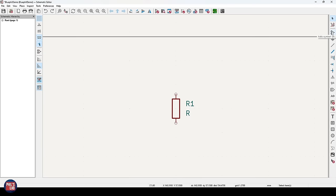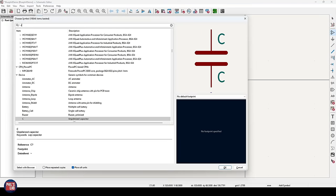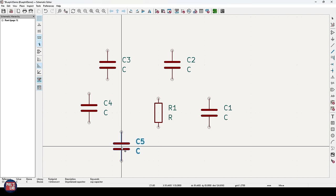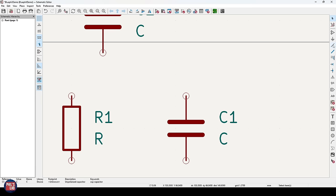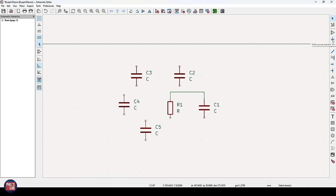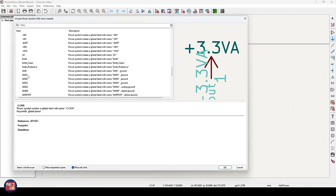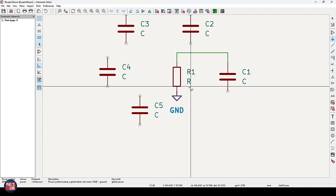Other than hovering over nodes, you can press W or click the wire command on the right side to draw wires. To add a power symbol such as ground or 3.3V, press P or click the ground symbol on the right — this opens a menu with predefined power and ground symbols. Press L or click 'add net label' on the right to label nets. Net labels are important because without them you see names like 'Net C1 Pad 1', but with a label you can give the net a meaningful name like 'RC', which is especially useful when hooking up USB and other interfaces.